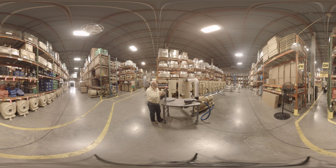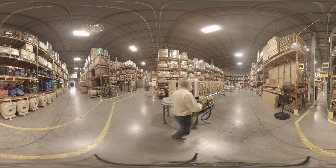So at this point we re-engineered our blades and our diffuser plates. Most importantly, we took this impeller here and we die-cut it — we bent it and kept it the same size so it fits snug against the plates with a 1/8-inch flat surface. We then put rivet holes in here and kept the exact same curve, tipped out just a hair, and we're able to rivet this together so we get no wobble and no runout. We balance these blades at 800 RPMs — that's what these rivets are for on the other side here. Without the runout, we have less wobble, longer life, better balancing, and it's going to perform better year after year.